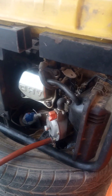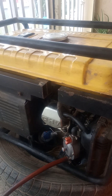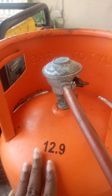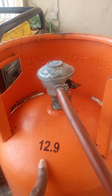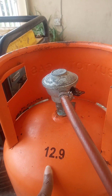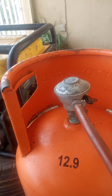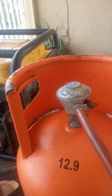This particular test was carried out and I can assure you that there wasn't any leakage. As I said in the methodology when I started this video, we are going to take this cylinder back to the gas station and weigh it again. Whatever we get is the difference we will subtract from the initial weight of this cylinder, and that will give us the amount of kg of LPG required to run this generator for 2 hours under about 33% loading.